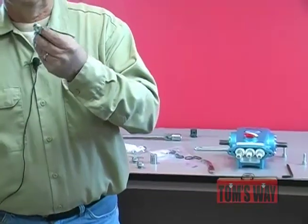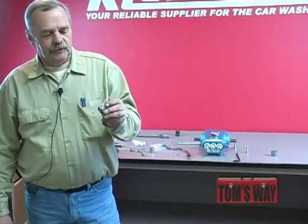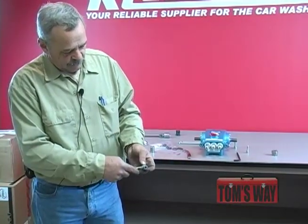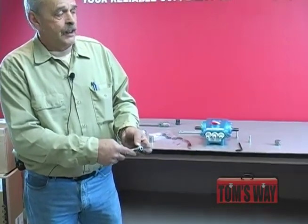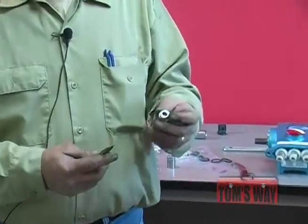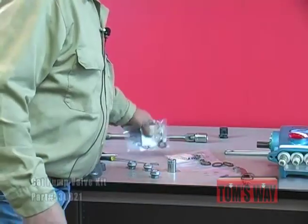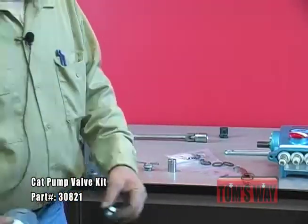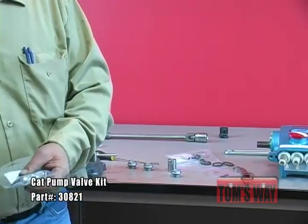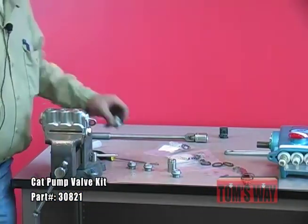You have the spring and holder. If you're having vibration in your pump, 99% of the time it's going to be these. You have to make sure it's clean between the valve and the valve seat. The easiest way to find out whether it's sealed or not is to suck on it — if you suck no air through it, the valve's in good shape. Check the O-ring and backup ring on the valve seat. If they're in good shape, they go back in again. When you buy a valve kit, it comes with three valves and the O-rings for the caps. These valves are in good shape, so I'm not going to replace them in this pump.